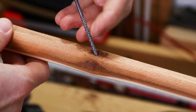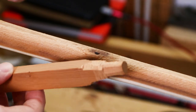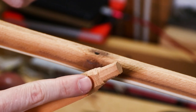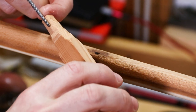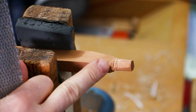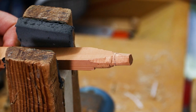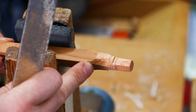I just found a tool here that will actually fit into the hole and go right down to the base — take a rough reading. Here's the piece of wood that is going to match approximately in color. I've already taken some of it down using a saw just to get the basic start of the round shape, so I can mark off roughly where I want that depth to be. I've made sure my cuts with the saw have gone down beyond that mark, and I'm just going to use a rasp to round this off to as cylindrical a shape as I can get.